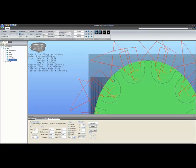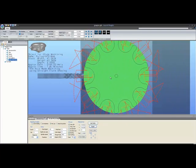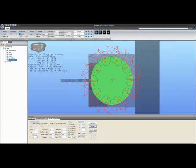It will probably give you that bulb shape, but the routing is not going to be able to do a very good routing of this round area. So while a toolpath on an HTD such as this one could theoretically get you close to the shape you're looking for, I would expect that you would have to take a file to this and dress it up quite a bit to get what you're looking for.